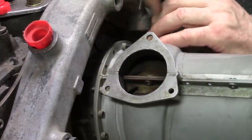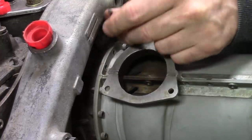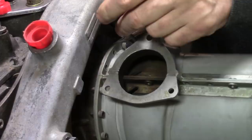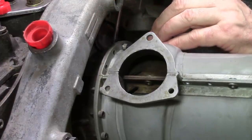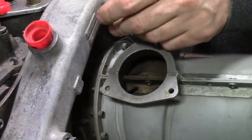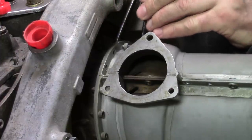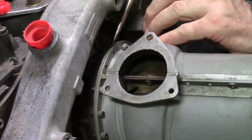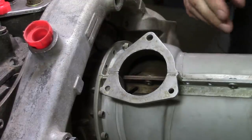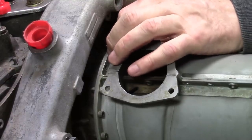They're going to be put back together with a torque wrench for sure. Getting them started is always the fun part. We're going to clean these bolts too because they're a little grungy — we want to make them look like jewels. There were a couple of dowel bolts in there, and those are the ones we'll do up first. They have very low clearance in the holes so they ensure the accurate positioning of parts.